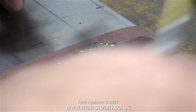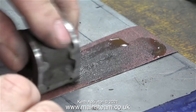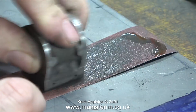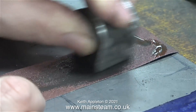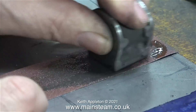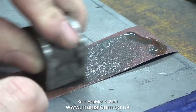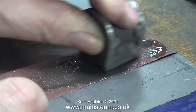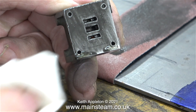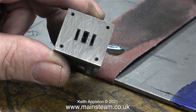This job makes a bit of a scratching noise, and I would normally leave the audio on, but at the moment I'm using my tumbler polisher to clean up some parts for this engine — it's just a loud rattling noise, and it's driving me nuts. So I'm sparing you that by muting the audio. Another good reason to use oil is because you can see how much metal you're removing by the state of the residue — the more metal you remove, the darker the residue.